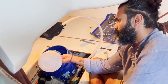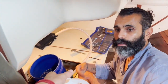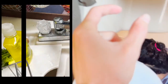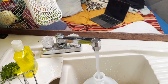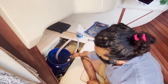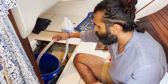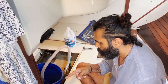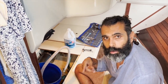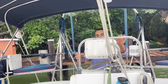Each payload here is a gallon, so four of these mixed into the bucket makes a four-to-one ratio. Now I have the bucket with the solution — five gallons total — and the hose submerged inside. I'm going to start the engine and watch the impeller in the raw water pump suck all this water into the system, then leave it running.